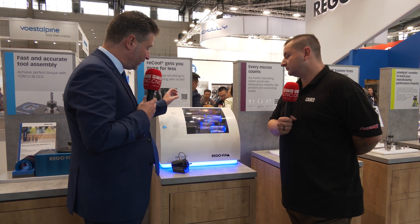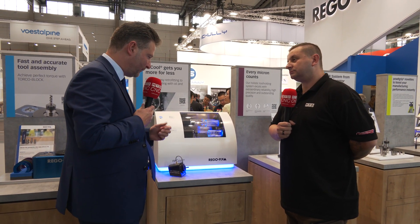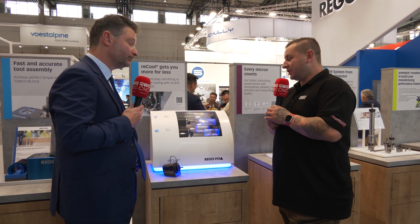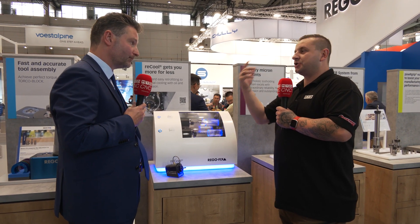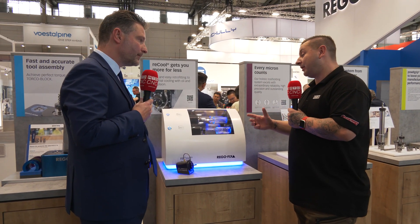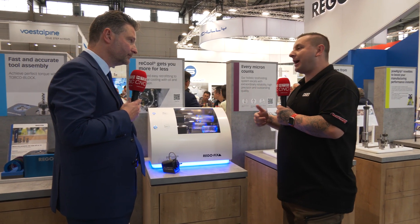You take away the nut on your driven tool, put the external coolant tube to the nut, connect it, and then the external cooler is guided to the rear cooler, bringing coolant properly to your cutting tool — whether it's a drill for internal coolant or, with another sealing disc, peripheral coolant. A lot of driven tools don't have the option for internal coolant, and with this you can retrofit any machine in less than two minutes to true coolant options. I used to use angle heads quite a lot and the biggest problem was always swarf evacuation — trying to bend the hoses and then swarf hitting them. An absolute game changer.